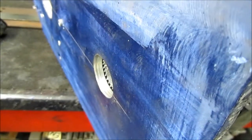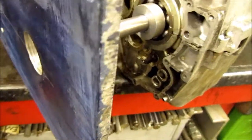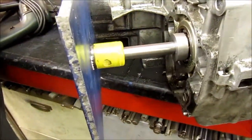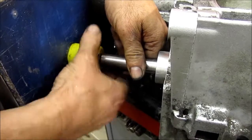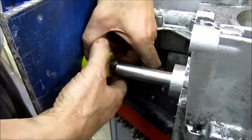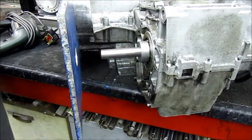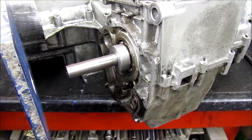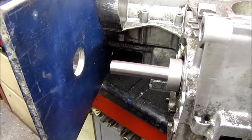The next stage is the sprocket — there are a couple of options at the minute and it's probably going to be one of the expensive little things. The tricky part was making sure the hole was in exactly the right place. It took several hours of planning and setting up, but only about half an hour to actually cut the hole. Now the tooling is all set up should another one ever be needed.